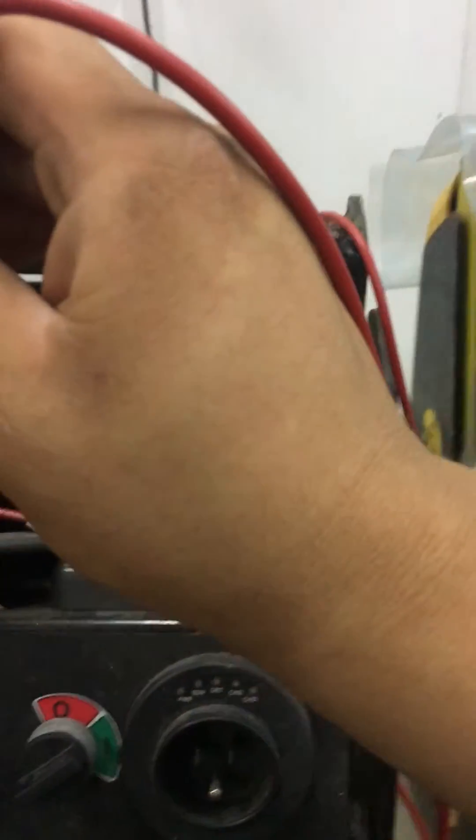Because it's supposed to be getting full voltage going across. So on that pallet jack, after checking all the connections and looking at bolts — I had the right bolts everywhere I needed. It was either gonna be the main contactor or the batteries. It's way easier to test the batteries than the contactor, so you gotta disconnect all the batteries and test them one by one.